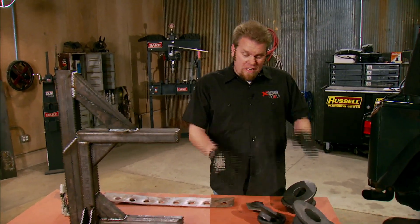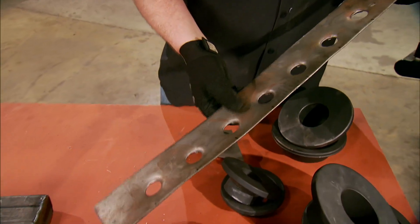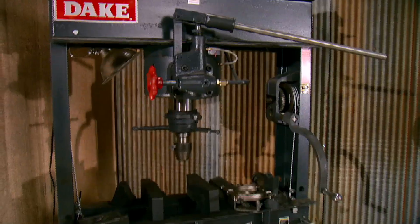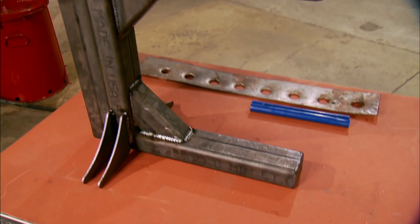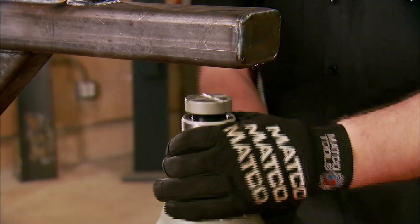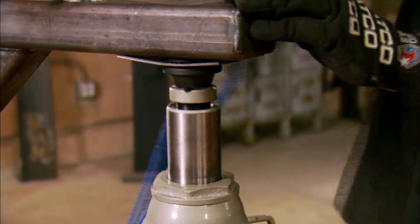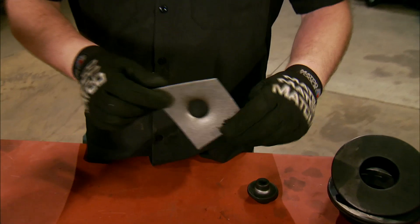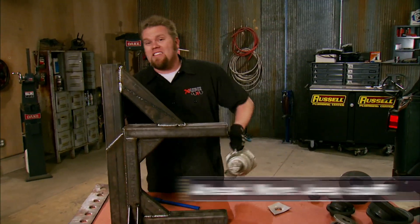There's no question that a good set of dimple dies — like this one from Light Racing — can not only make a piece of flat steel look a lot better, but can actually make it a lot stronger. The one downfall has always been that you need a press to squish the two dies together. Since not everyone has a 50-ton hydraulic press, here's one we made out of simple rectangular tubing and a $50 bottle jack. You just place the jack between the two sections and use the pressure against the top and bottom sections to put the dimple into the sheet. A pretty good looking speed hole in the plate — all for $25 worth of scrap steel and a little bottle jack. And the nice thing is, this setup is portable.